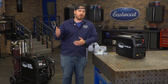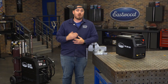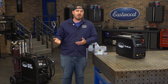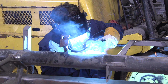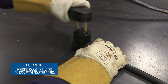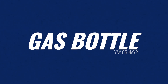If you know you're going to be welding super thick frame steel all the time, you should probably look at 240 volts. Our Make 250 runs off of 240 volts and can weld up to a half-inch thick steel. On the flip side, our Make 140 runs off 120 volts and can weld steel up to 3/16-inch thick. If you're only going to be welding sheet metal on a car or smaller frame rails, that might be plenty. Most of our welders even offer the ability to run off both 120 and 240 volts, so if you only have 120 now and think you might upgrade down the road, you can pick up one of those.